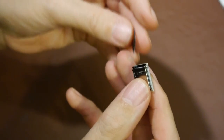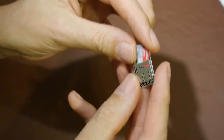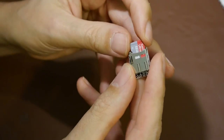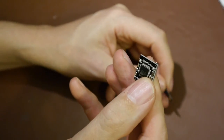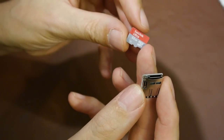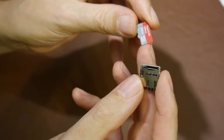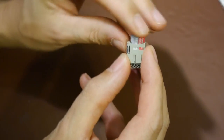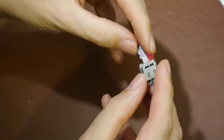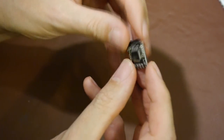Here's the SD socket, and here's a miniature SD card - you put it in upside down. So basically you plug this little thing into your circuit, it records the RS232 and writes it to the SD card, then you take the SD card out, put it in an adapter, stick it in your laptop, and read all the data off. Quite a handy little device.